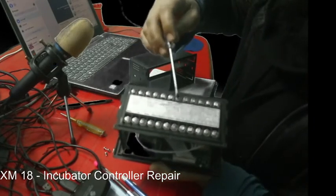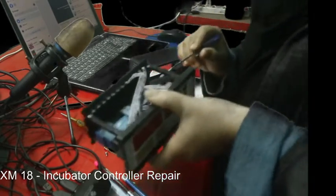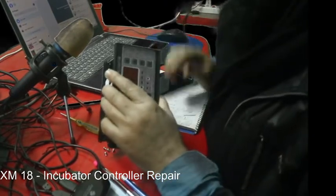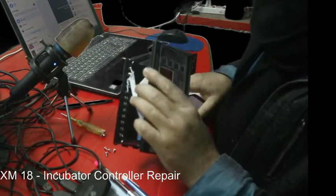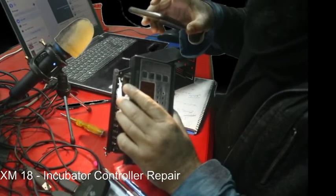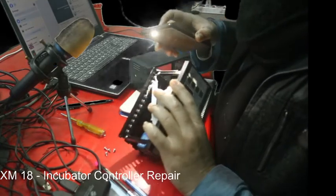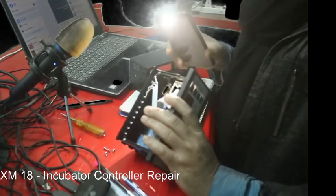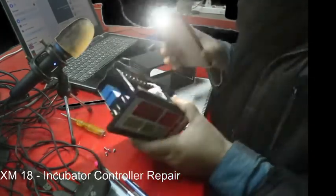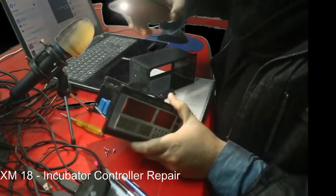Let's see if anything is happening at the input — this 230 volt AC terminal is this one. After this we have some isolation component. Let me use a torch — this is MKPX2, 300 volt. There is no fuse at all inside it, we cannot tell what happened.